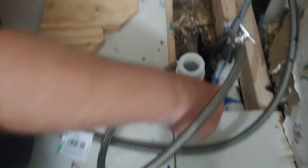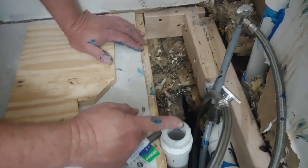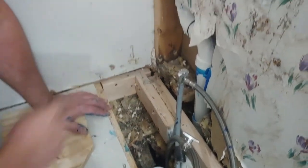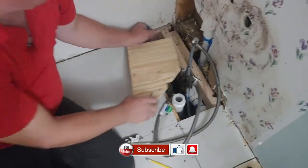So we cut into two-inch, put an adapter, put a T right in the trap where it needs to be — right here. And then the vent has to go back up through the wall. We've done all that and repositioned the lines so they're inside.